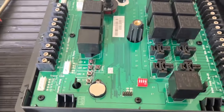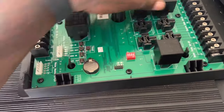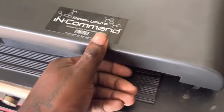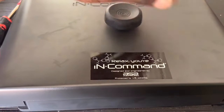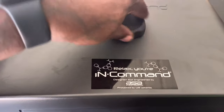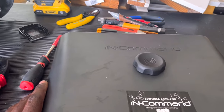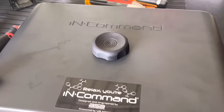This unit is about eight thousand dollars. If you're replacing or working on one, that's your terminating resistor — you definitely want to know what you're doing and you don't want to burn it up. If you do, that's not going to go over well with your customer or at a dealership. It's not that hard: take pictures before disconnecting, disconnect all power, unplug it physically, take the wires off the battery, disconnect the solar controllers, then work on it. Do not work on this with any type of power going to it.